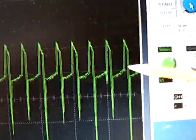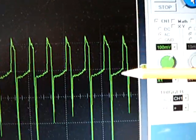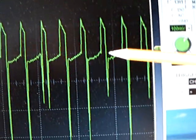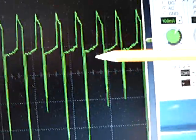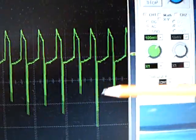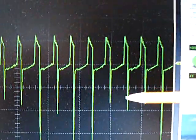Each division here is 100 millivolts, so you can see how small the voltage is. The divisions here are 0.2 seconds, so it's firing about five times a second right now. This spike right here is the back spike, and I believe that is what is driving the LED through the induction of the secondary.